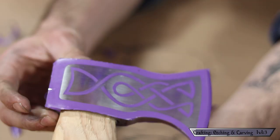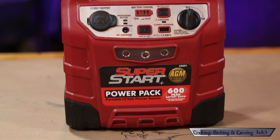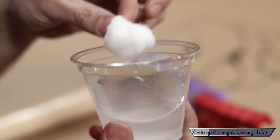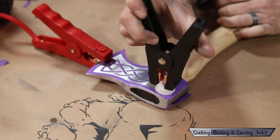Go really carefully with this part as it's going to determine how well your etching comes out. With our design in place and ready to go, we can move on to etching. Just like in the 9-volt battery episode, our materials include cotton balls, table salt, and water. For power though, I've upgraded to a 12-volt car battery jump starter pack. I'm pretty sure you could still use a 9-volt but it would take a lot longer — I really wanted these raised areas quite raised, and that extra power output is what made it go quickly. Prepare your electrolyte solution by adding copious amounts of salt to a little bit of water. Connect your positive clamp to some exposed metal — remember, it has to be the positive clamp. Soak a cotton ball in your salt solution, secure it to the end of your negative clamp, then power up your battery pack and press the cotton ball to the face of the axe. I left it in one spot for a count of 10 before moving on.